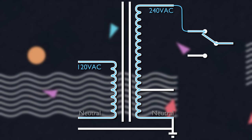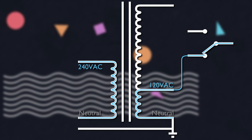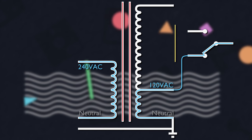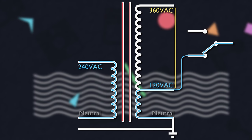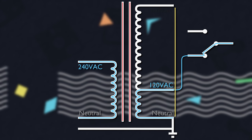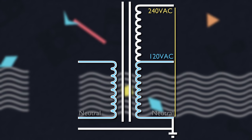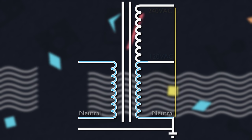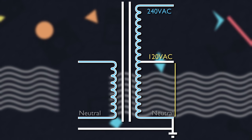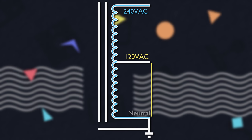There was another property of transformers I hadn't considered that explains how this one works. If we have this model switched to step up, we get 240 volts on the secondary, but we actually have two secondaries because the unused section of the primary also interacts with the magnetic field. Measuring the ends of that section gives 360 volts because it's three times longer than the part receiving mains. Since it's part of the same coil, you can measure the total length and get 480 volts. Moving the quarter tap to the halfway point gets that down to 240. From here we can drop the secondary altogether and generate all the voltages we want with just one winding — and this is how an auto transformer works.